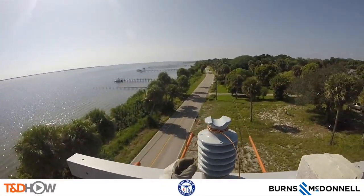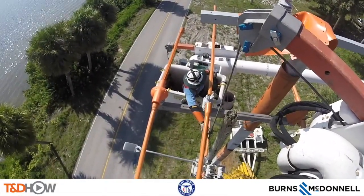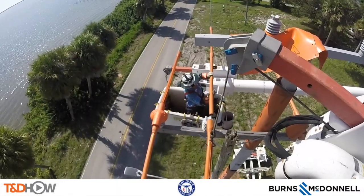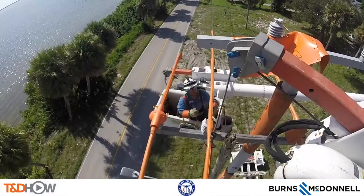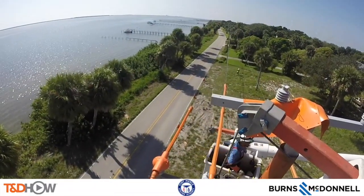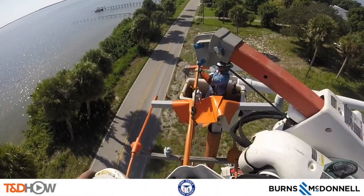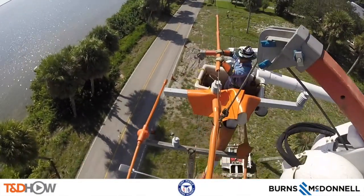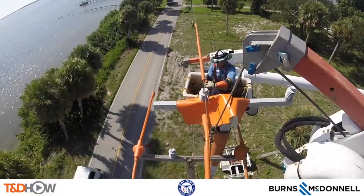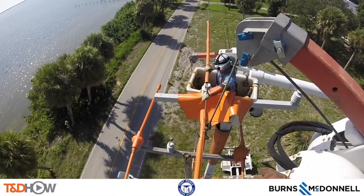You'll see each insulator as we show the movement of the energized lines from the old cross arm to the new. You see a jib and a line with a hook on it — that hook is going to grab this energized line and move it. They're starting with phase B, the inside phase, so that they can then go out and do the outer phases. You see it being taken from its old wooden cross arm up to the new fiberglass cross arm on top of the newly installed concrete pole, then set in place. Next, he'll use those short copper wires attached to the insulator to tie in this distribution line to the new insulator.